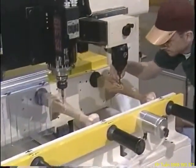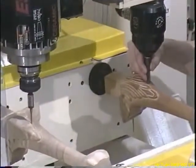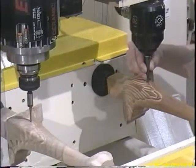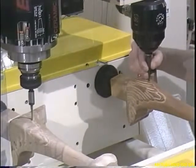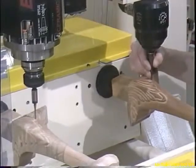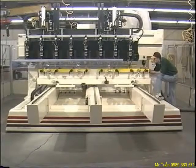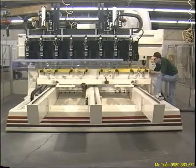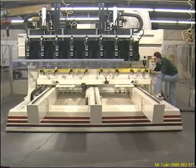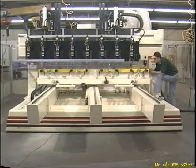During this process the machine is guided manually over the detail to teach the machine the required path. Programming speed is irrelevant, so you can move slowly and carefully. The system then creates the most efficient program possible. This approach is simple and intuitive enough that even people with no carving experience can make efficient production programs. Final finish software simplifies and smooths the program motions to reduce cycle time and improve finish, and it's a standard part of the Thermwood CNC carving package.